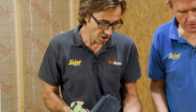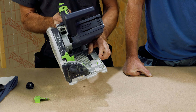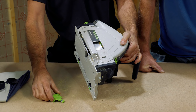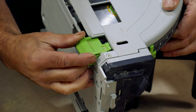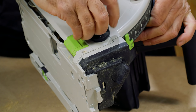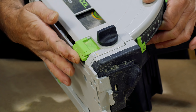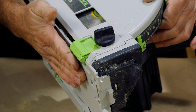You still wouldn't be able to start the machine up anyway, but we always say take the batteries out - whatever you're doing, take the batteries out. You've got the retractable riving knife here, which is a nice feature, enabling you to use it like a riving knife or plunge cut as well. Just going to release this - remember to hang on to the bottom of the saw when you release that, otherwise it's going to jolt out. It's got quite a good spring because a plunge saw needs a spring to resist against you. This knob is just to tighten it up onto your rail, and these little devices control how freely it runs.